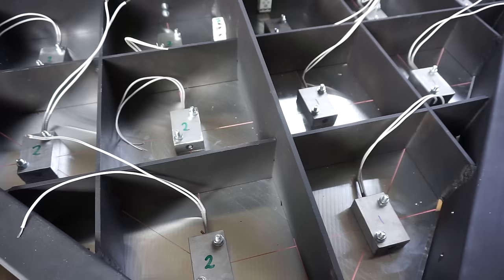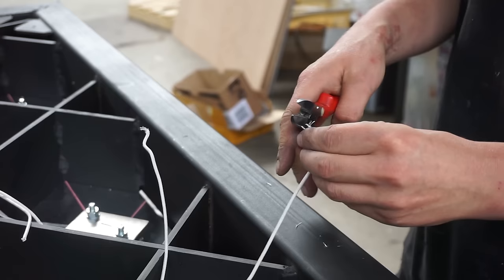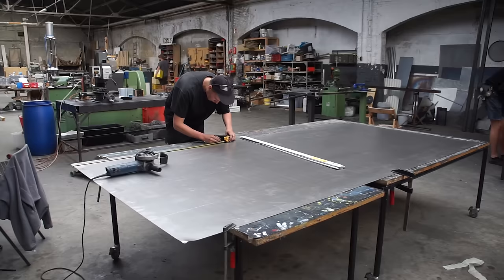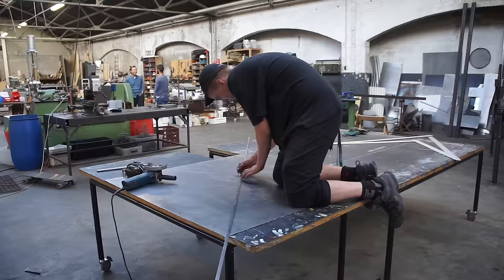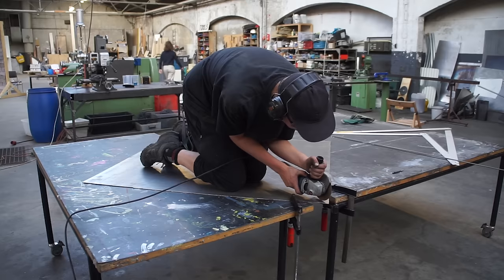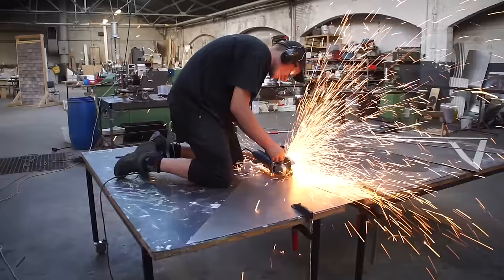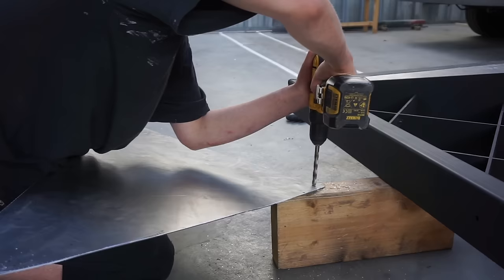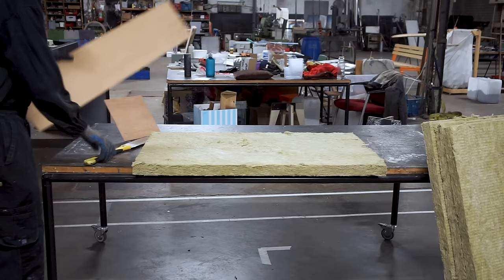We need to adjust the circuit diagram to distribute the heaters evenly. We numbered them with which phase they belong to, to avoid confusion. You may need to extend the cables from the cartridge heaters — if you do, make sure you solder and insulate them with solder and heat shrink that can withstand high temperatures. Next, make the body panels for the pressing plates: start by cutting and grinding them. You can use the mounting tabs on the pressing plates to mark the centre of the holes. Then cut and insert the insulation material.